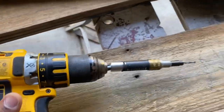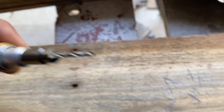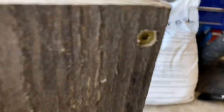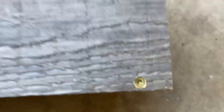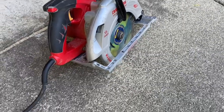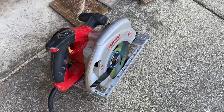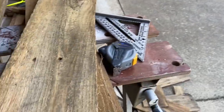For the drill, I'm using a bit that can drill a pilot hole as well as a countersink — that really helps so that you don't split your wood when drilling into the ends of the board, allowing you to sink the screw without splitting. You're also going to need a circular saw, a tape measure, and a straight edge — a square is better so you know you're making your cuts square.